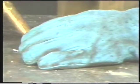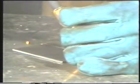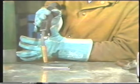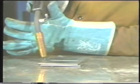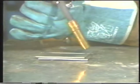For a butt joint in the flat position, tack each end of the plate, leaving about a 3/32 inch gap between the pieces. With the tack pieces in a flat position, make sure the area under the joint is free and clear to allow for full penetration. Hold the gun at a 90-degree angle so that it is pointing directly into the joint. You may weld with the gun in this position, or you may choose a leading or trailing lead angle as you travel across the joint.